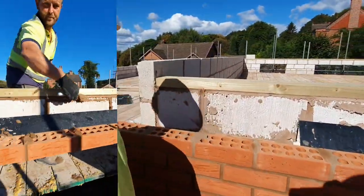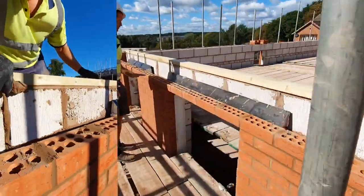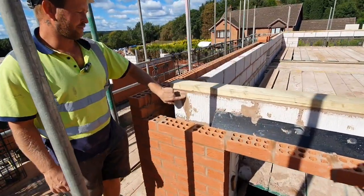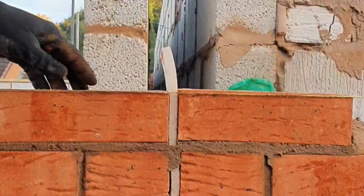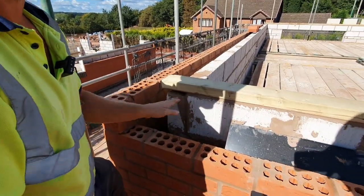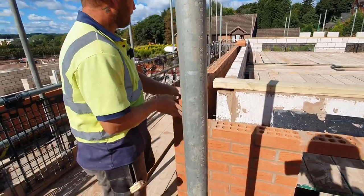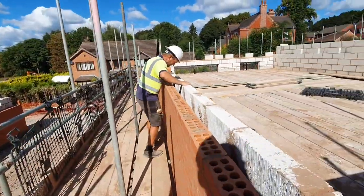Another thing — wall plates. This is all on, it's a step down, but it's exactly the same detail. We run everything through at the same time. Wall plates, nice and flush where they meet, and they're left over 100mm long. He's pointed that because he doesn't realise yet, but now he knows — he knows why I leave that bit of mortar out. I always build this up a couple so I can pull off it when I come into my end.